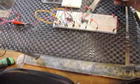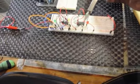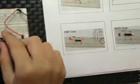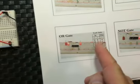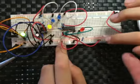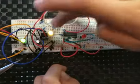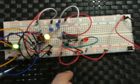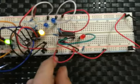When you plug in things to the chip, everything connected to that part of the chip is lined up here. So all of these are then connected to that. So we're working on an OR gate, and we're going to work with 0, 0 at first. So show the 0, 0s. 0 and 0 makes 0. So the blue lights come on when those are actually in 1, or the high voltage.